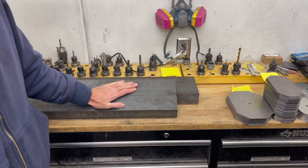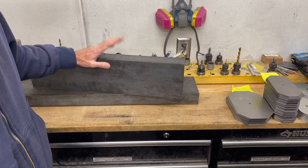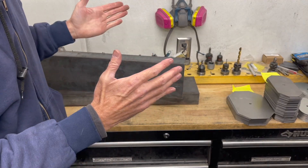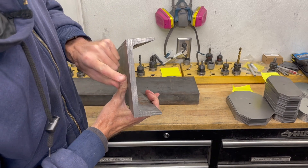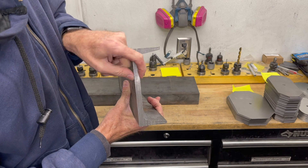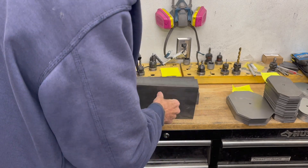I'm not exactly an engineer — I'm actually an electrician turned manufacturer. As far as the design of this, I basically just looked at the Harbor Freight version of a 50-ton press, looked at the steel that they used, and since I'm making it smaller it doesn't need to be as strong. I actually went with a thicker C-channel — this is a 6 by 2 and something, what they call a 6 by 13 pound, with about 0.43 inches on the web, so it should be pretty strong.